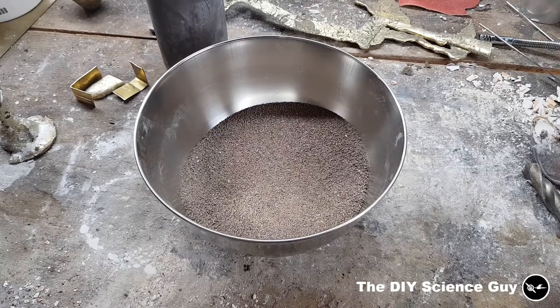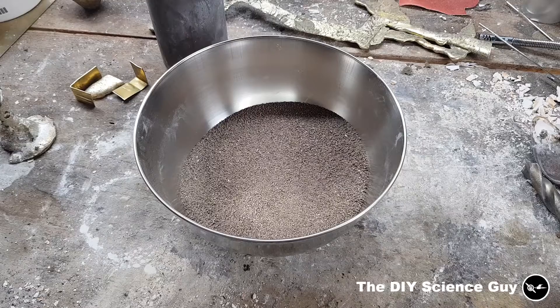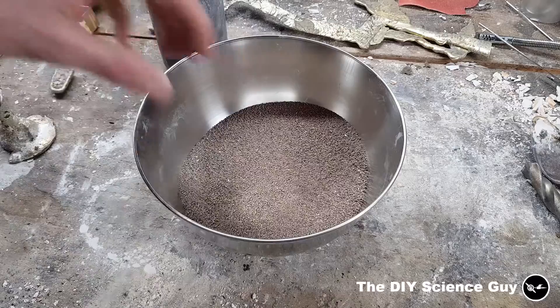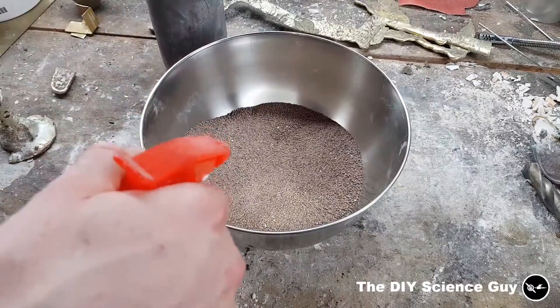So because making a plaster mold every time I want to do a test is just too time consuming, I'm going back to sand casting. And I did that just by using normal sand mixed in with a bit of bentonite clay. I got that clay from moisture absorbent packs, which you can often find in packages when they are sent to you, so they're pretty easy to come by. So this is just a mixture — I need to make that a little bit more moist.